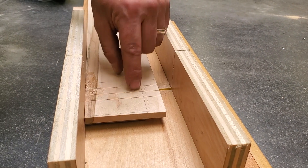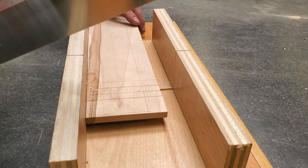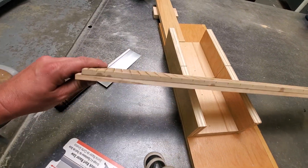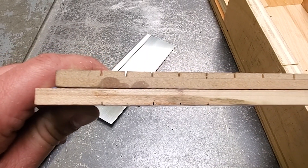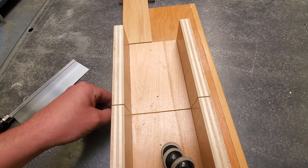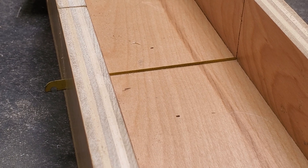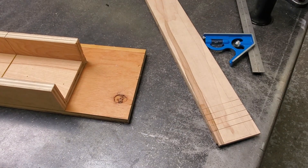I really like the idea of not having to use math every time or having to put a template down on paper and trace it. I'll speed things up a bit and continue up the board — this template will get traced onto the back. That hacksaw blade piece just comes in and out, so if I ever need to replace things or change the depth I can just put a different blade in. So that is a very simple way to do repeatable fret cuts — two to three millimeters, or about an eighth of an inch depth.